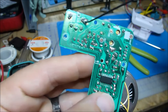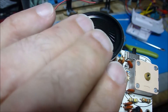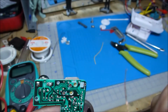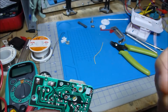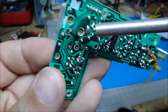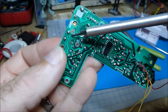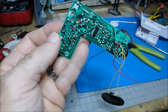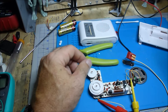Right here for our antenna — these are where we should solder them in and they do have holes through the circuit board, so I'm pretty sure the wire should go through here and through this hole. If you look very closely, they are pre-tinned. If yours are not, you really need to scrape the varnish off the wires and pre-tin those wires. Here's a mistake I made — if I wanted the wire to go through the hole, I already put the capacitor on, so I'm just going to solder these up. I'm going to hot-glue all these wires; they're real cheap and pretty sure they're going to come out with any movement, so I'll put some hot glue on there to get some strain relief.